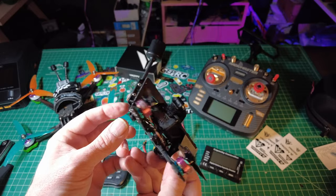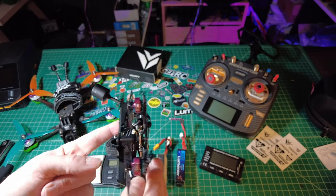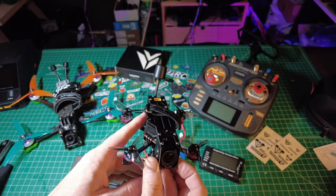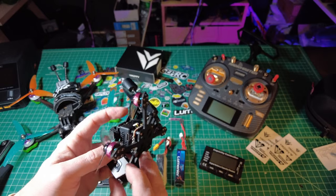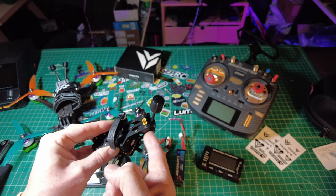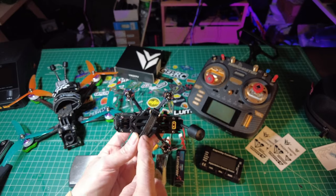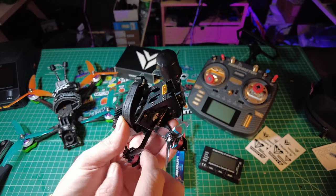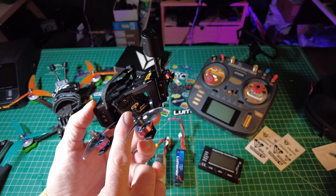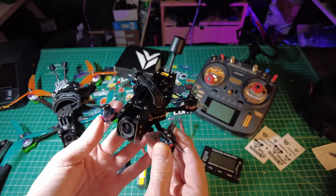There's even detail on the inside back here — they have a little aluminum plate that goes over top of the receiver and mounts it in a vertical fashion, and it probably fits a TBS nano in there, standing it up away from the flight controller and the O3. There are two M2 bolts that hold it on each side. Getting the antenna back through here, I had to remove the XT30. It also has a PCB that slides into the backside of this mount — it's very well thought out and engineered. The top plate requires quite a few bolts to remove — it's not going to be a simple top plate to remove. The other downside of this quad would be putting this together with an O3. The easy part is that you just plug in this little harness — you don't have to solder anything to the board. They already have the O3 harness there for you, no soldering required. I haven't done any soldering on this entire quad to go out and fly today.